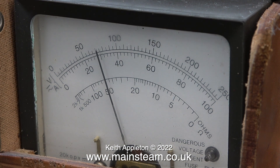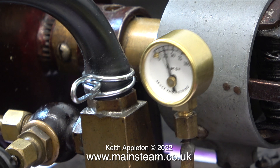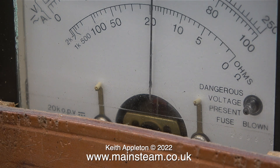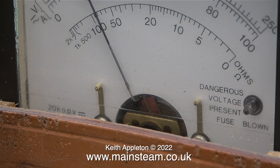Now I can really crank up the turbine. As you can see, the faster the turbine goes the more electricity I'm generating. Unfortunately though, this turbine uses so much air that the pressure from the compressor starts to drop fairly quickly. This wouldn't happen if I was using steam because the steam would be constantly being generated by the fire in the boiler, and I also think the turbine runs better on steam because it's denser. The air supply from the 50-litre tank ran down so much that the twin compressor units kicked in to replenish the air.